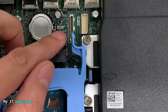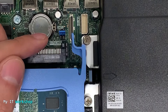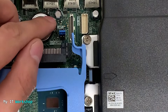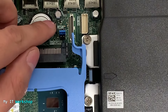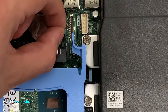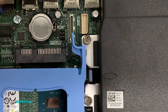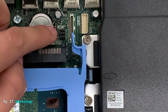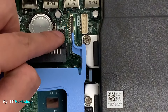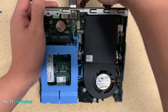I'll do a close-up. You can see some pins here — this is what you have to look for. Above them it says 'JMP', which is jumper number one. We have three rows: one on top, one in the middle, and one on the bottom. The one we need to remove is the one in the middle. Very gently remove it — you don't have to use much force. I'm showing you now: we have removed the middle one.